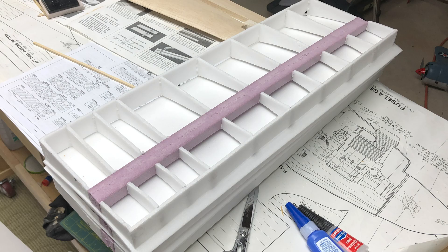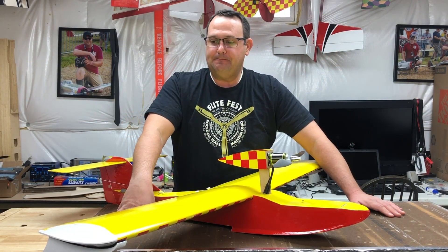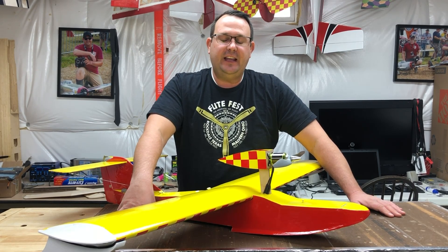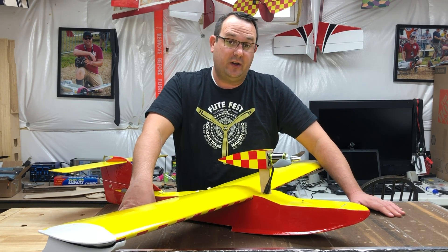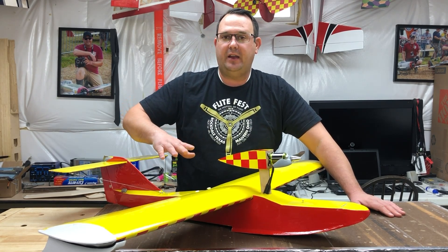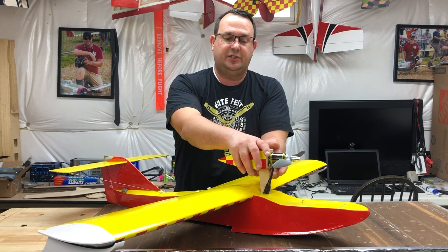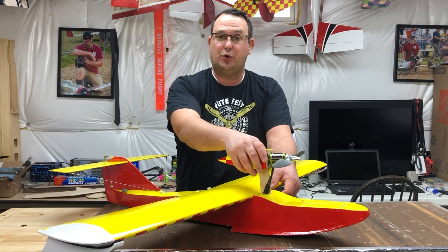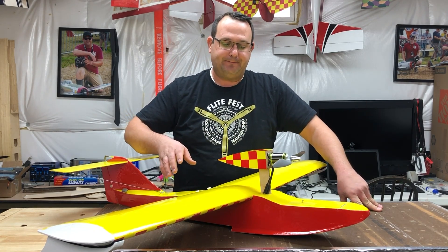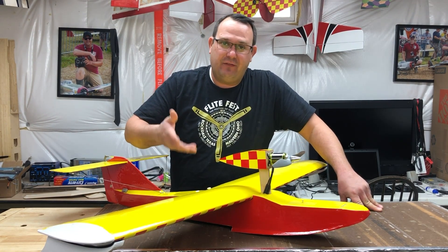It seemed like the hardest part of the build was actually the fuselage, just because the wings were so dead easy. From there it's just figuring out and sizing things — accounting for the thickness of the foam where you're going to use it, and then factoring in what needs to be strong. I used balsa and plywood on the top and bottom just to manage the torsional twisting of the fuselage, especially because you've got a motor pod that's elevated above. I didn't want this twisting moment to translate into the fuselage. I probably could have gotten away with less wood and used more foam, but I had everything I needed, so I figured why not.